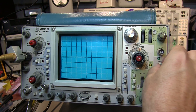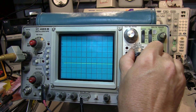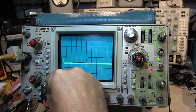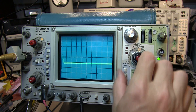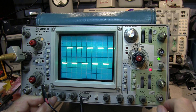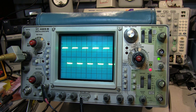Let's fire it up and make sure everything works. I'll attach the probe to the probe compensation signal and hook up ground. Let me turn the intensity up and see where I'm triggering — the level is adjusting up or down, so I know the level is working right. That's triggering on the falling edge and the rising edge. Looks like that very simple repair was effective and done. I wish all repairs were that easy.